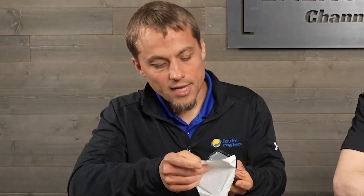This has a sticky butyl at the bottom. If I peel that off a bit, you can see it sticks to the roof. What that does is fill in every nook and cranny of the roof, so you can't have any water get underneath and into the holes, into the penetrations. And then it has a thin layer of foam right in between there, and when that foam gets squeezed it becomes completely waterproof as it compresses.